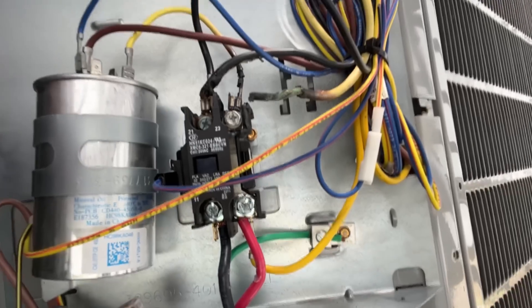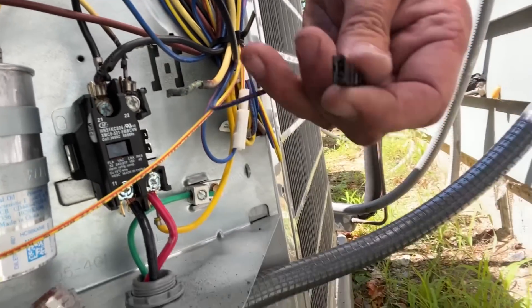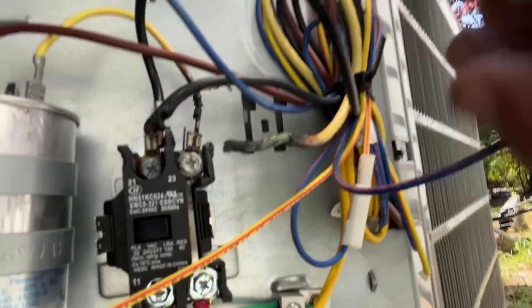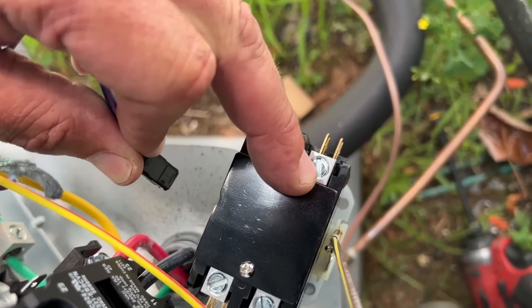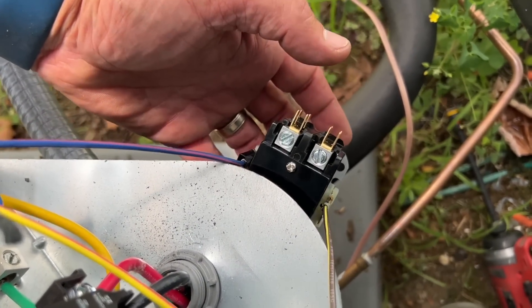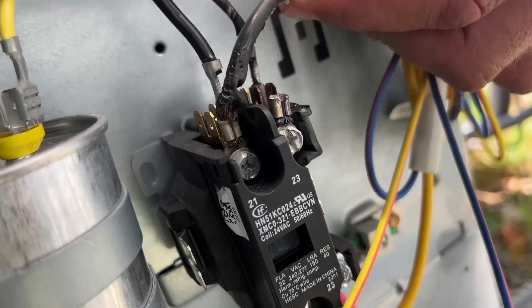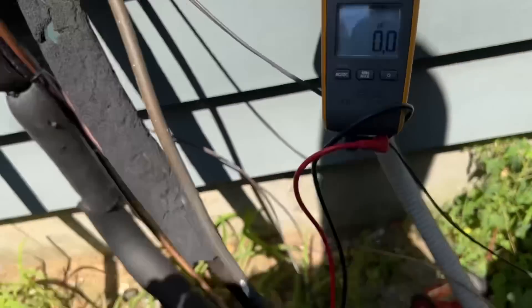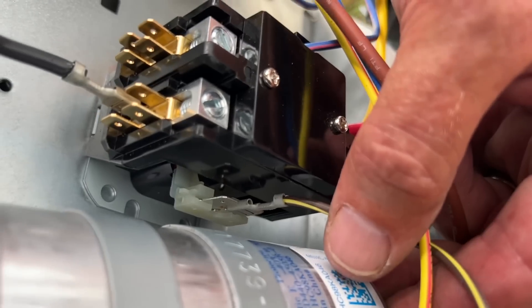Let's take a look at this contactor. It looks like she's permanently pulled in — the contactor is permanently pulled in and I don't have any power to it, but it's still pulled in. A new contactor already. I can see I still have 24 volts, so I guess I'm good. I'm very curious as to why this happened — brand new unit, brand new unit.